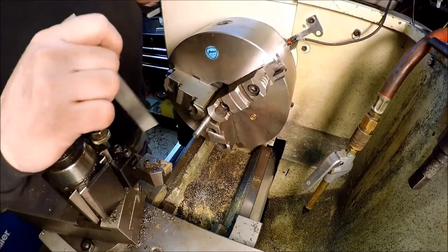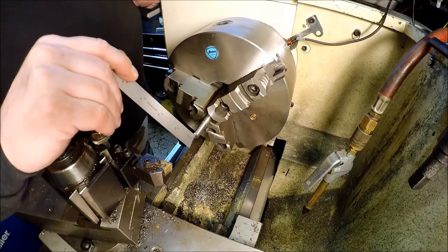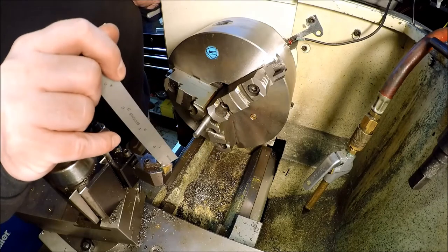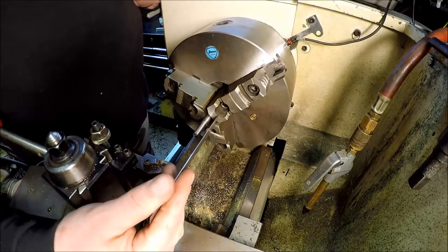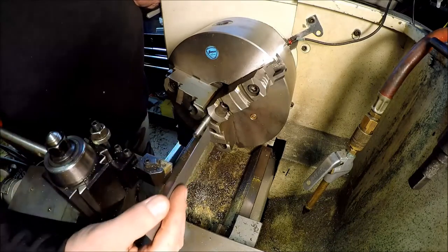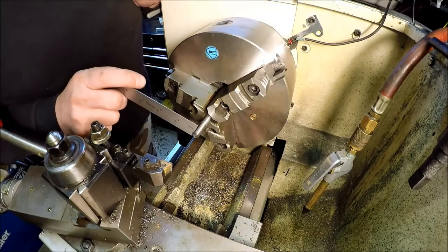Just trying to explain something in case you are kind of new to machining, that's why you're watching my channel. What's happening is the tool pressure is pushing this piece away from the tool post and the tool itself. The farther it sticks out of the chuck, the worse flex you're going to get. Also, as the part gets thinner, it's less supported, and it's going to flex even more. So what happens is you get a taper. And to try to combat that, you've got a couple things.